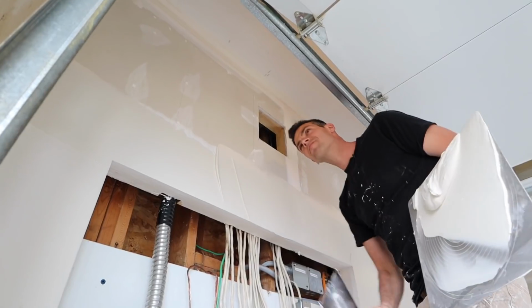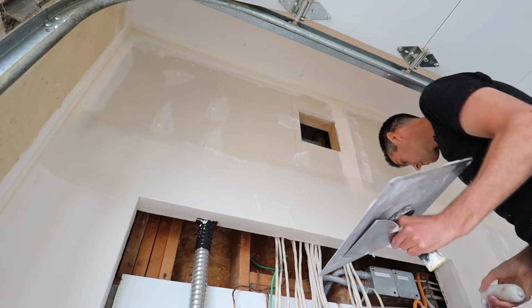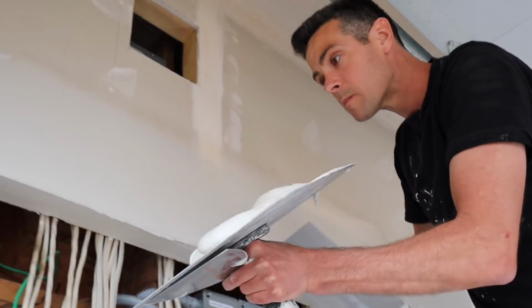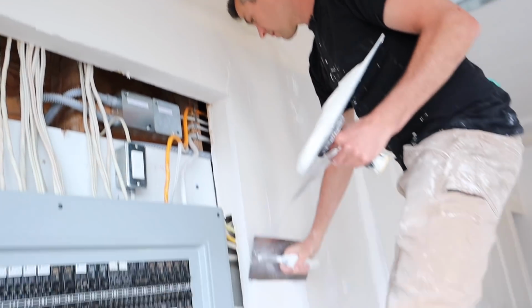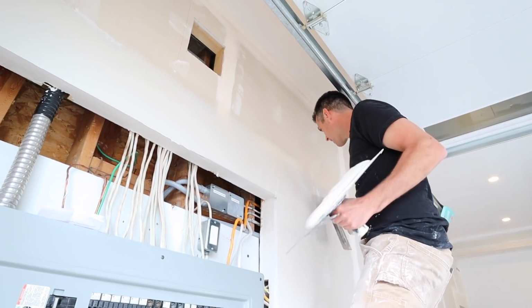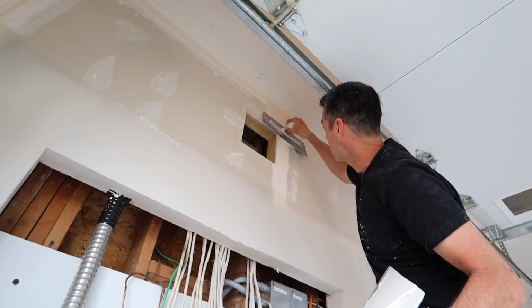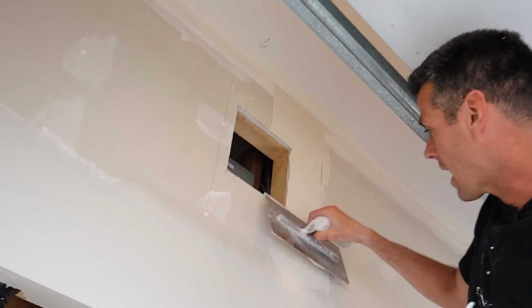That one didn't apply there. Feather that edge. If you're getting something out of this video, feather that like button. Don't smash it. Okay, one more to get the porosity out. They're looking good. Feather that edge again. Okay, one more. All right, I'm happy with that. Get this flat joint. These are nice because they don't take a lot of mud. You can almost just wipe them flat.